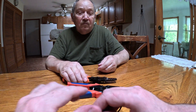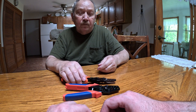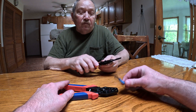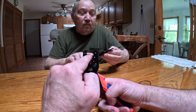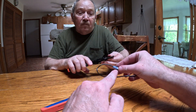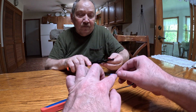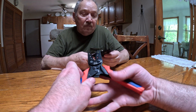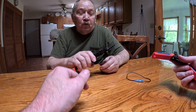Steve has been an electrician for about 50 years. He says he likes them and would use them. Specifically, he likes the color coding so you can just match up to it. He also likes that the crimping surface is square — a lot of crimpers are round and can actually puncture through the connector instead of mating it down, which breaks the seal and forces you to cut and reuse. The flat, square design gives more of a push instead of a puncture.